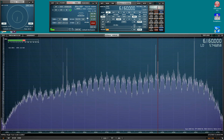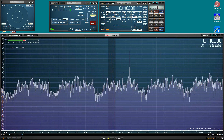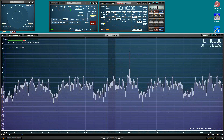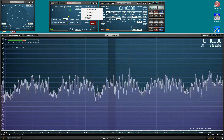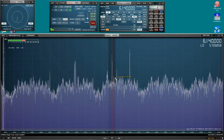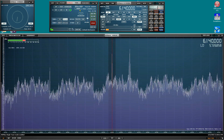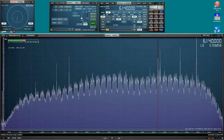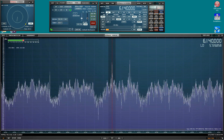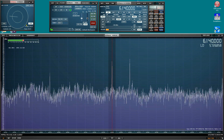That is about a hundred times easier to listen to. That noise would drive me nuts after a while. Let's go to 6140 real quick and zoom in — there's Brother Stare, actually stronger than my steady signal. Quick look at tuner two: just the noise on the noise antenna. Now signal plus noise on the real antenna — there goes a beacon sounder — and now let's go to diversity and bring the spectrum to center. You can see the noise piles here.